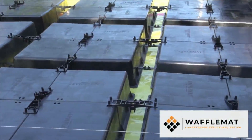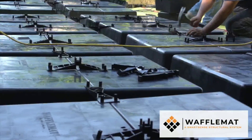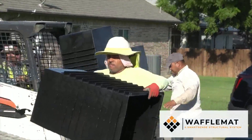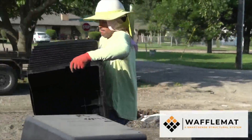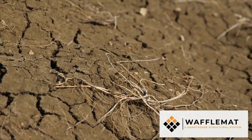Second, a series of waffle boxes — eight and a half inch tall, 19 by 19 inch void forms — are placed throughout the footprint of the building pad following the engineer's design. Since the waffle boxes are primarily void and occupy only about 20% of the contact area, 80% of the swell experienced by alternative slabs are mitigated with the waffle mat.